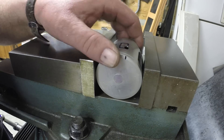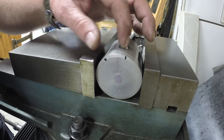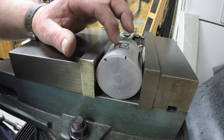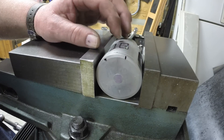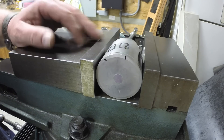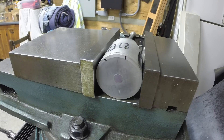I've changed the approach. I've got the piston grabbed in here, rotated where the center of the slot I'm going to be cutting is up at the top. Once I get it cut out to the dimensions, I'll rotate it over, get the center of the other slot lined up, and cut it out to the same dimensions so they'll be the same width and height. I've got my cutter installed and my vise with the piston in it. I'll bring it over and find my starting point.